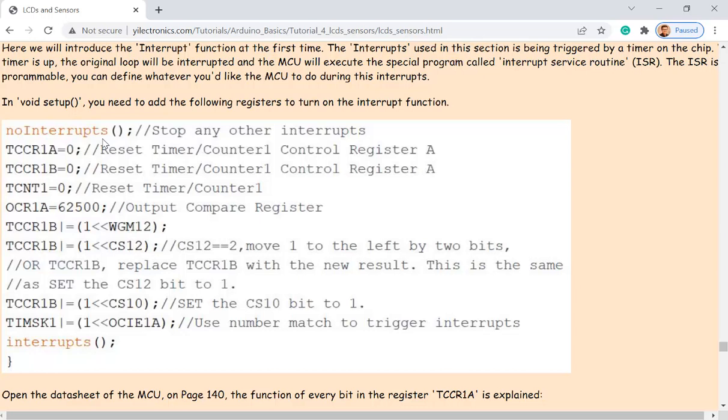So every 5 minutes, I'm going to trigger that sub function, which is going to do the serial communication with the sensor. So get the data, one byte or something, and then display again. And then just hold it there. Don't change it for 5 minutes. And the next 5 minutes, come back to do it.